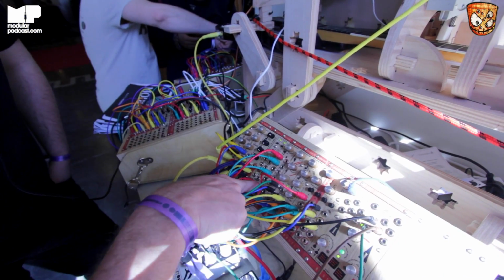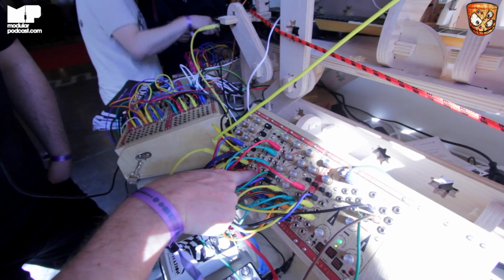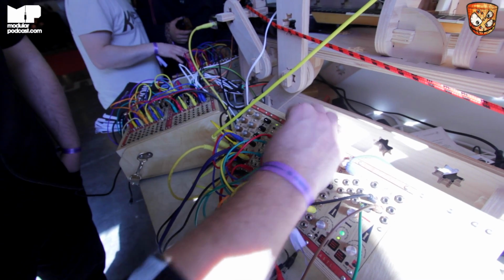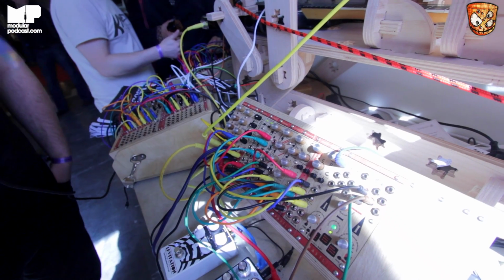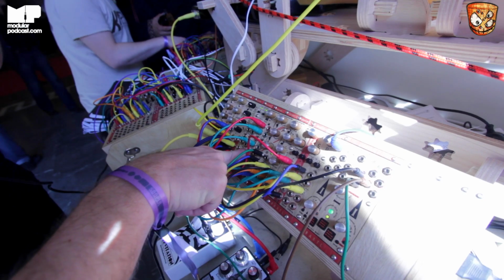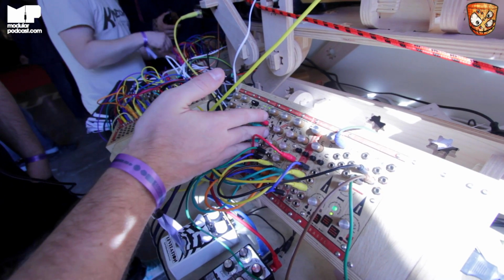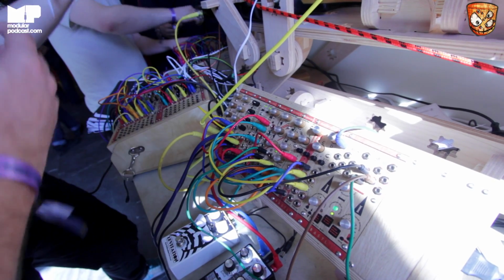And then there is a compressor curve generator. If you take this CV and plug it into the CV input of your VCA, you get a compressor. Let me tell you how it works. You set the threshold here, and once the loudness of the signal reaches the threshold, as on a compressor, it starts to generate a negative voltage on this output and starts to duck like a compressor will. Exactly, and it ducks the VCA. But it doesn't have the amplification cell, and it doesn't have the VCA inside. So you could get compressor style ducking on a filter or a wave folder.